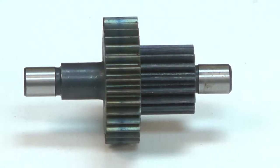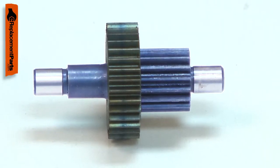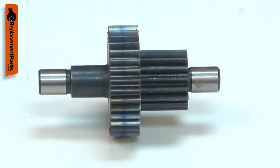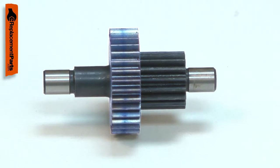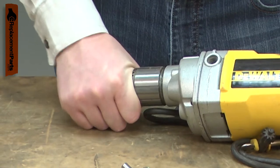The gear and spindle is a reduction gear inside your drill's gearbox. The assembly consists of a spindle that has a spur gear milled on it and a separate spur gear that is pressed onto the spindle. Over time, the gears will wear, leading to excessive gear lash and noisy operation.